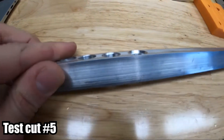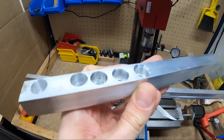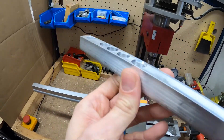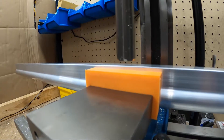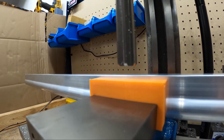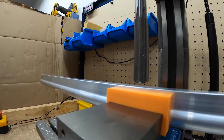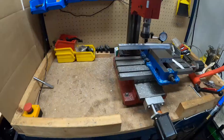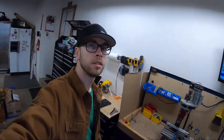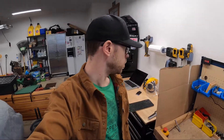It seemed like when I ran the ream through afterwards I actually made a small burr — I think I'm going to run the ream before I chamfer going forward. The only other issue is the ream isn't square, it has a taper so it doesn't cut to the bottom. I might actually have to grind the end down so it reaches the bottom. But I've got it set up and hopefully this is the final program and final test cut — then when we get back to it we'll just machine the final part.